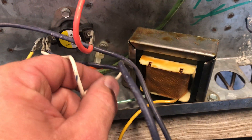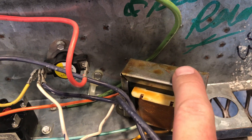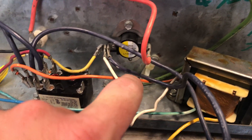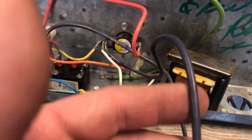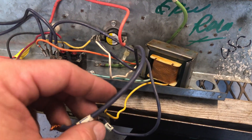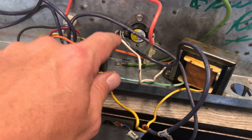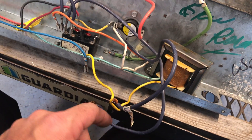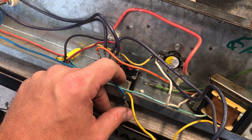On this bank right here you have yellow, which is for your fan. You have white — this white one is actually the other line of the 240 volts going into your transformer. Then you've got this one which is your other leg of the 240 volts. So you've got one leg here that sends voltage to this little guy, and then your other leg goes here.